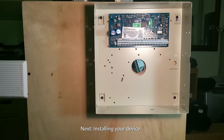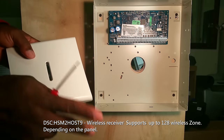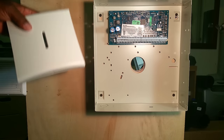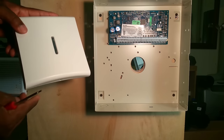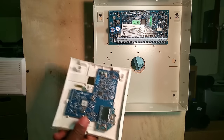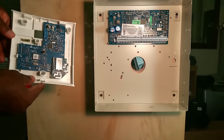Now that we have the can mounted, it's time to start installing your devices. Next, we're going to install our wireless transceiver. It's called a transceiver because it can do two-way communication, so you can have a wireless keypad communicating back with this panel. You can only have one receiver. It's rated to do 1.2-mile line-of-sight wireless, and you can add repeaters to extend the signal. What I like about this receiver is it comes with an actual level inside, so it makes mounting much easier.